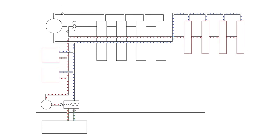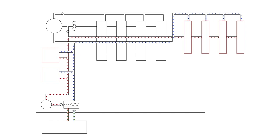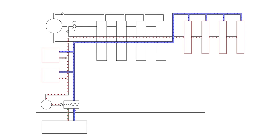It's then directed into a main processed water manifold, which takes the water and delivers it to the entire system. A portion of the water cools the granulating machines. Another portion of that same water goes through the molding machines. The return water from both comes back to the tank at the pump package, and is then recycled back through the chiller or the heat exchanger.